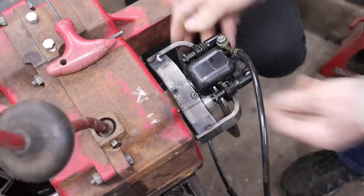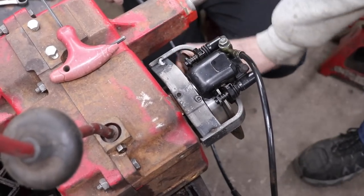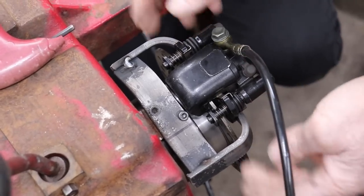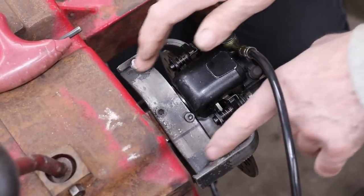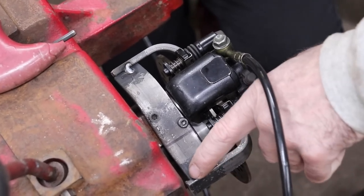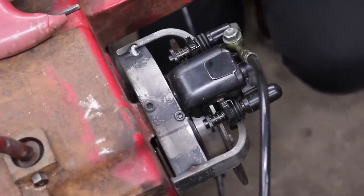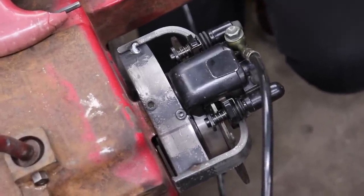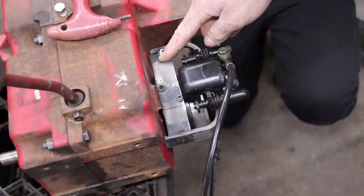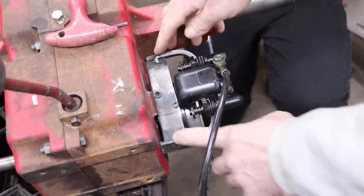So it doesn't rub on the caliper, but yet the pads are on the disc. So now just two bolts here. I can take this off, weld it up, smooth it out, grind it, because it's a little long here, I'll cut that off. But that's what you do when you mock it up. And I bent this all real easy in the vise with a crescent wrench. And I'll show you how I did that in case you want to do something like this.